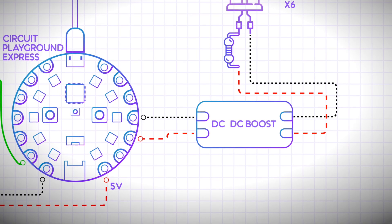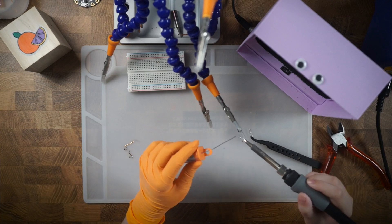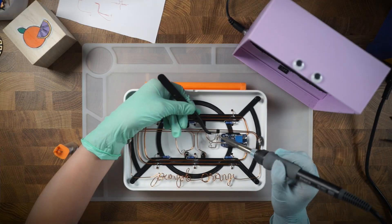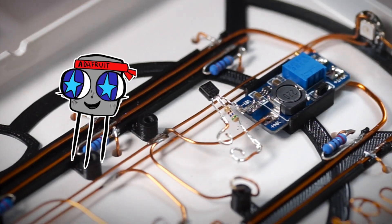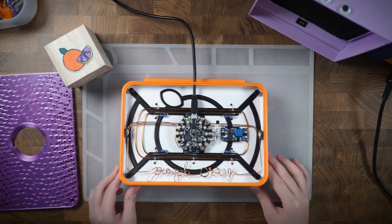Because the CPX doesn't output enough voltage to power the LEDs, I had to use a DC-DC converter board to power it to the right amount. At this point I discovered a small miscalculation — the CPX pads don't have enough power. I needed to power the LEDs from the 5V direct power. This meant I needed to add a transistor to my circuit. It was a simple addition, and after that minor detour, everything in the circuit was working.